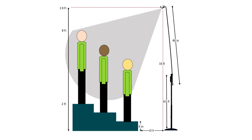So like the 60 degree cone we were talking about earlier, that would be an example of a cardioid microphone. And typically that's what I use if I'm able to use them, if I have them. A time when I might use a hypercardioid microphone would be if I want to get a little closer to the source, because I have a louder stage, I got an organ or a drum set or something on stage that I'm trying to hear my choir over.